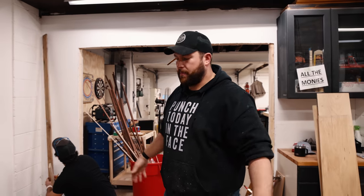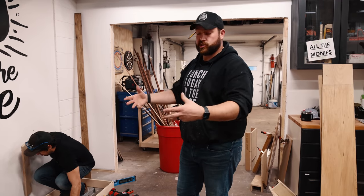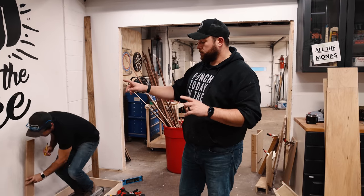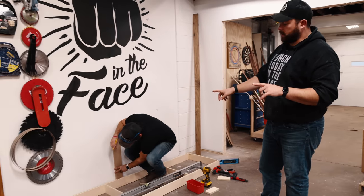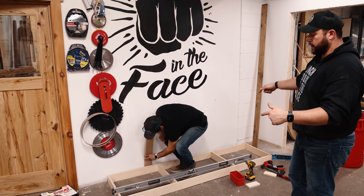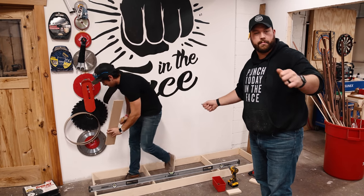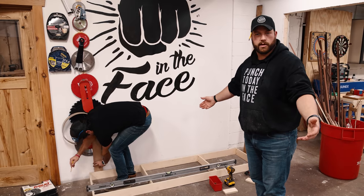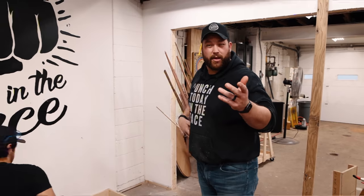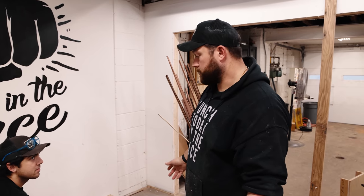Because this is like a seven-foot-wide bank of cabinets, we are building the toe kick separate and then leveling that, so we can just slide the cabinet on and not have to worry about leveling it after. Jordan's marking where our studs are on the wall first, then we'll level this box using some blocks, and then mock up the carcass on top — same way you would do a built-in. We have a drain right here, and this ends up being the flattest, levelest part of the entire shop, so we're just going to bang it into the wall.